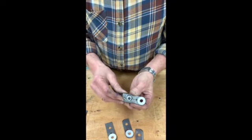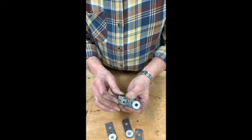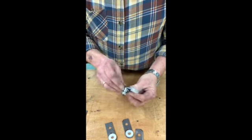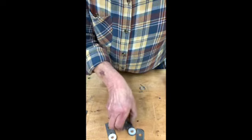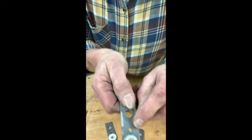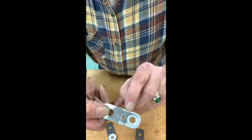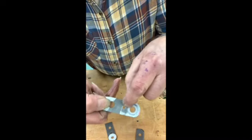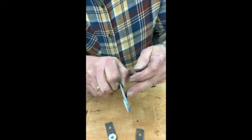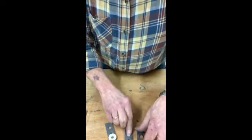So there's quite a lot of pressure on these torsion springs. I'm surprised that they made them that stiff. So I found that I had to mill a small little thing in there. Can you see that all right? I had to put a little cut in there to accommodate the end tab of that screw. Otherwise this was too thick to hold on to it.